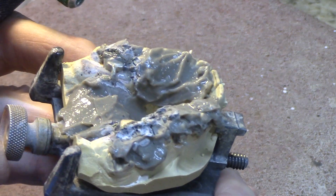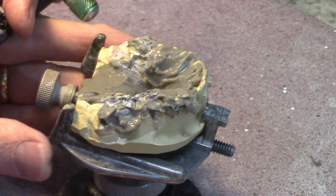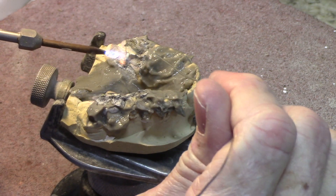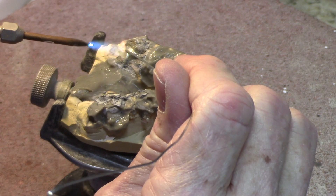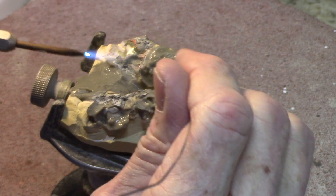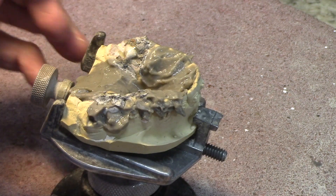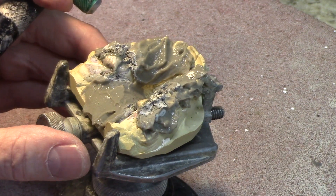Let's take a closer look at that — see how well sweated that is. I've got a lot of contact area of solder to the stainless steel crown. Actually, that stainless steel probably has some nickel in it, which is a good thing — and I know the wires especially have nickel in them. I'm just building up the bulk now, and everything is completely encased. That should be a very solid solder joint.